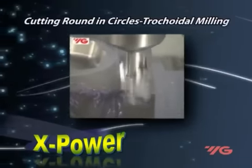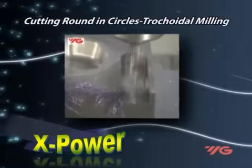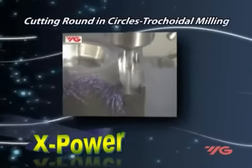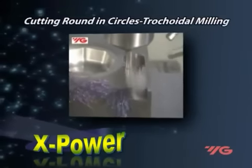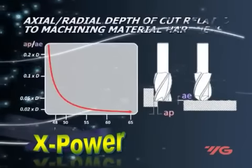The feed rate is always constant. This allows applying an end mill with a diameter smaller than the pocket's width, allowing room for chip evacuation. Cutting load and heat are reduced because of less cutter engagement with the workpiece. Trochoidal milling can cut narrow, wavy slots and hardened steel at up to 12 times the normal rate. Special software and a program are needed.